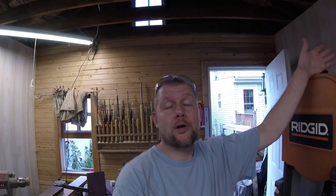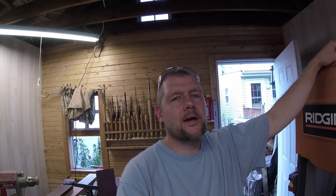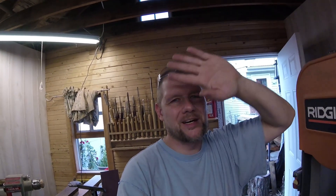Guide blocks — real easy, simple process. All bandsaws are different but in my case this one was really simple. It's going to extend the life of my blade and save money compared to steel ones that generate heat and burn up blades. The graphite ones wear more evenly and gradually. Hopefully you liked this — don't forget to like, comment, and subscribe. Get in your shop and keep making stuff. Have a nice one, see you next time!